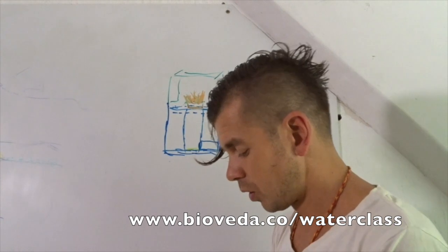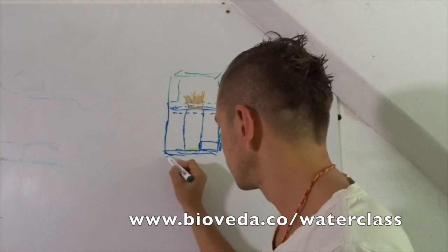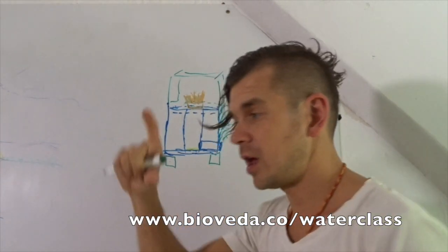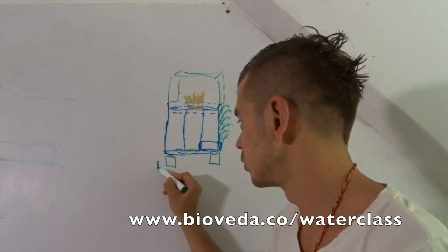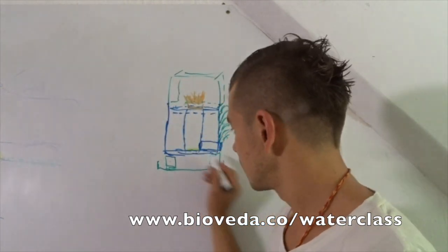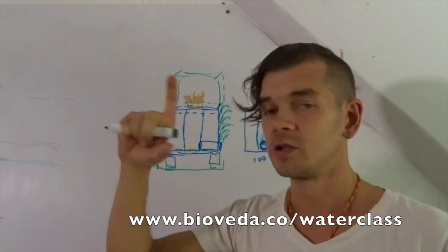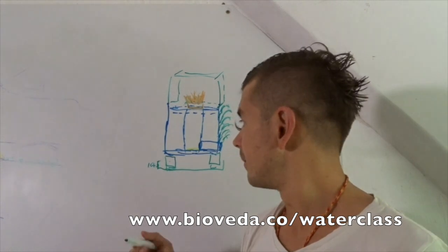So what I've done is, I would put this whole thing on a little block. Okay, I'd make a metal tray with sides that's maybe 10 centimeters bigger all around. You can get any metal company to do that for you. Okay, so these blocks will obviously sit there. Any water that spills over, and there will inevitably be some, okay? Any water that spills over will be collected in this tray. That could be 10 centimeters high, the sides of this tray. So it can take quite a bit of water, maybe 50 to 80 liters of spillage.